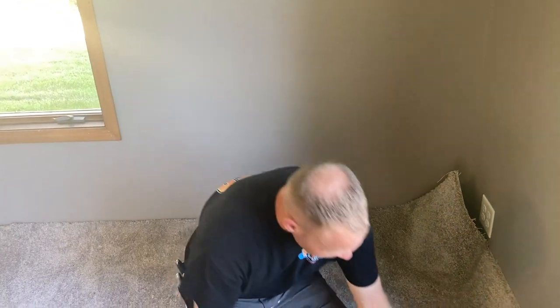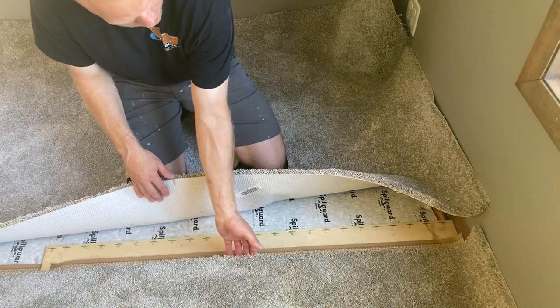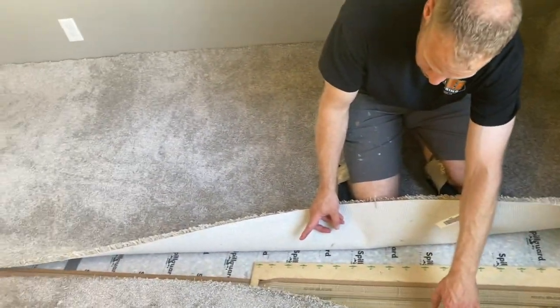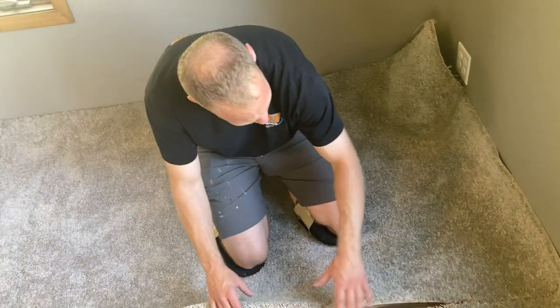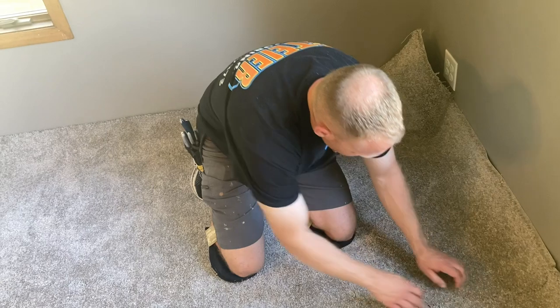So we've got a piece of 1/4-inch birch underlayment cut down there. We've got our Orcon XU90 through there, and that's my seam board, guys. I just run it like that, and I'll show you here in a little bit how I pull that along. But it's probably 4 feet. I'm not really sure. Just scrap. I make a lot of those because I don't know if you guys do it or not, but a lot of times I'll have 2 or 3 seam boards in my van, but then I'll be working on a project where I need a piece of plywood to either build a ramp or a shim or just something.